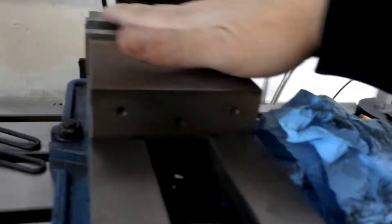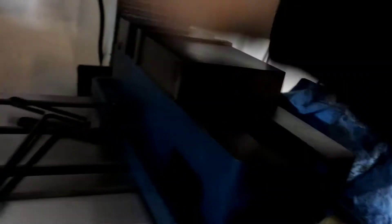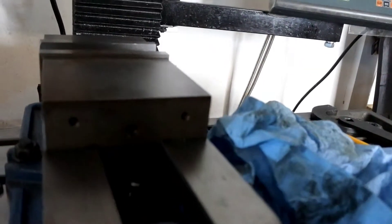Okay, so I got most of it done. Everything is finished up on the mill. The plate that stands it up — I showed you in that last clip — was a little bit too tall so I had to cut it. I had to cut about an inch and a half off of it to bring it down closer towards the table. Fun fact, that's the longest cut I've ever taken on this bandsaw — it's pretty straight, I'm pretty impressed with it. Anyway, I had to lower that plate down because when the piston sits up here — I made it so it clamps in the machine vise — the piston was way up high. The head is all the way up and the table doesn't go down, it's just the head that goes up. So I also had to cut some length off my boring bar.